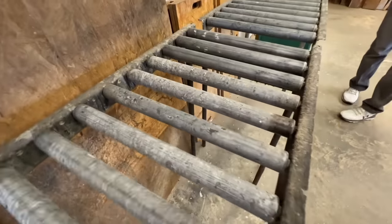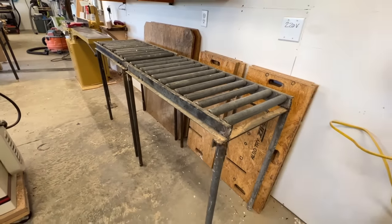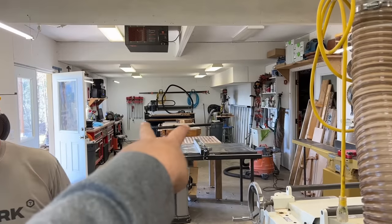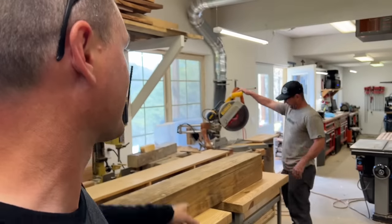In addition to the extension, I added rollers to support really long boards hanging off the back of the jointer — if you've got a 14-foot board you can't hold it flat otherwise. These rollers are adjusted to the height of the infeed side. These tools used to be where the CNC is now. To get the CNC in here I had to give up my radial arm saw, which I used a lot. But the chop saw kind of does that job, and these two tools I use regularly, so it made sense.